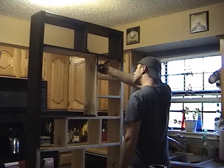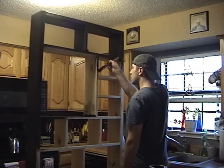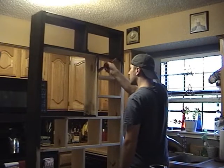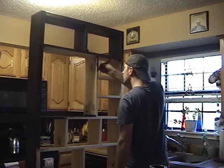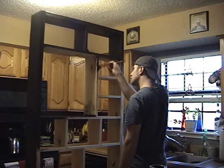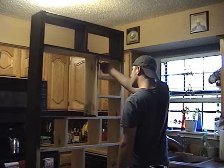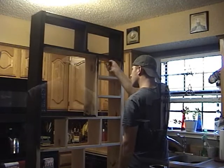We're allowing the paint to soak into the wood — the grain is going to be a different kind of thickness and density than the normal wood itself. That's the reason we're doing that: to give it an antique look. That way you wouldn't have to do a rubbing to show the grain through the paint itself.